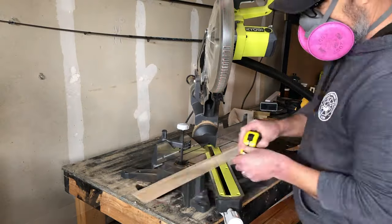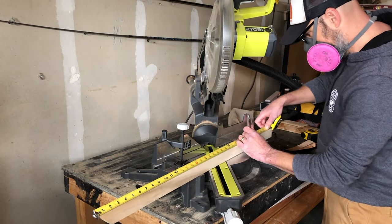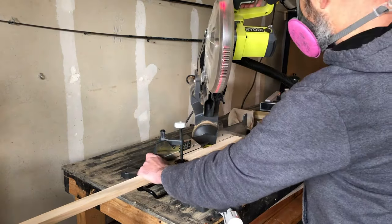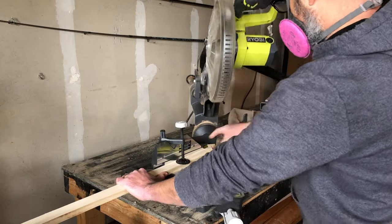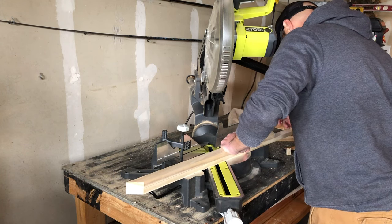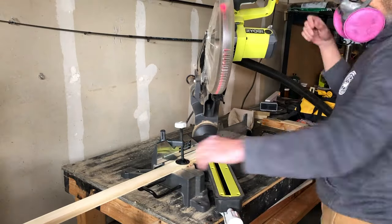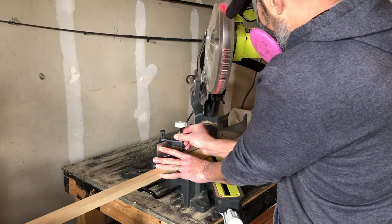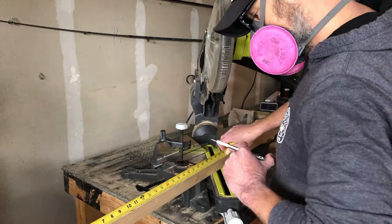So the first piece here, I'm just cutting my initial 45. Then I measure it — I've got all my measurements for the frame — so I'm doing my first cut at the exact measurement and putting my 45 on there. That laser I have on this saw is dead on from this angle. You can do it a lot of different ways: you can set up a fence with a stop block, or you can cut your pieces together. I'm just measuring the first one against the second one. It is most important to have your top and bottom pieces and your side pieces at the exact same measurements. You can always adjust your picture or inlay, but having the same dimensions is the biggest part.